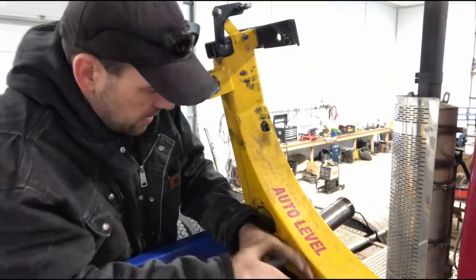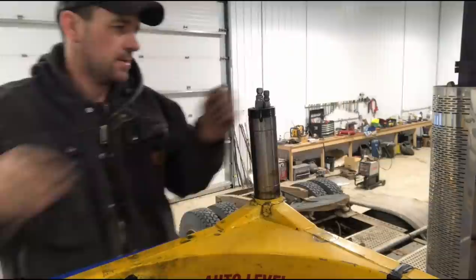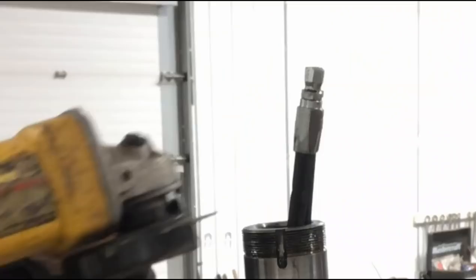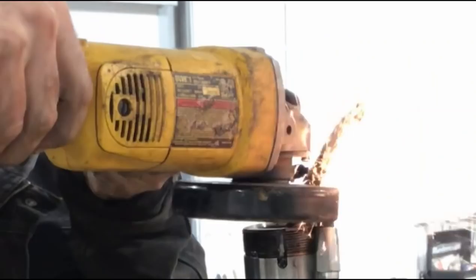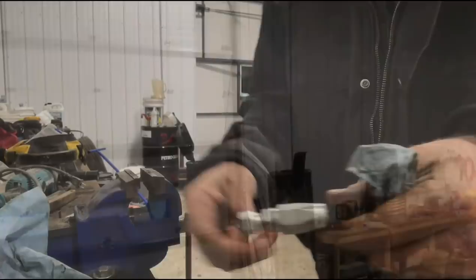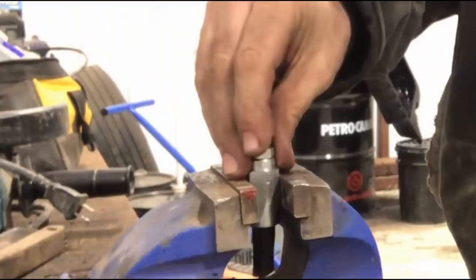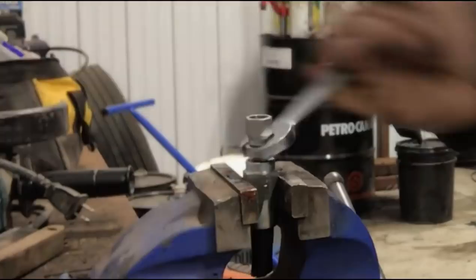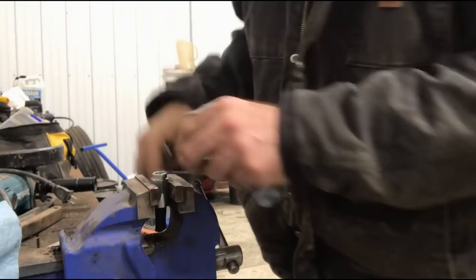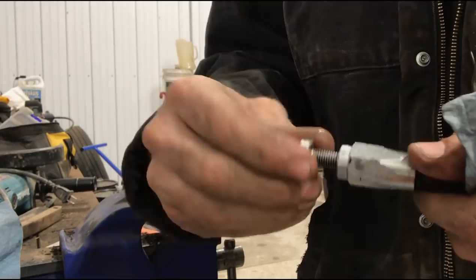There's a little slot in that tube to fit the hoses through because the crimped ends wouldn't fit. I called my brother over and he said these are twist-on ends, not actually machine-crimped. So I have to cut those off — no problem because I'm replacing these hydraulic lines anyway — and that allows me to pull them through the tube. When putting it back together, I'll get the ends crimped on properly, but at the head I'll use the twist-on function just as they did, to allow those hoses up and through. That should work just like it has for the last 10 years.